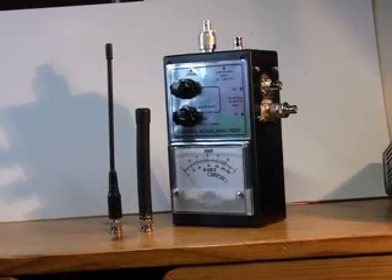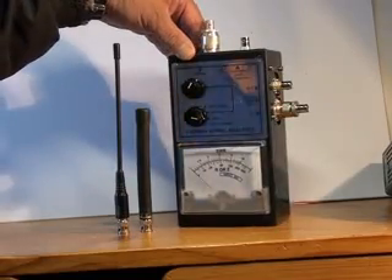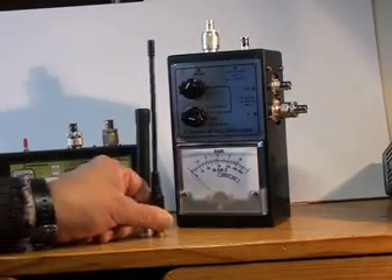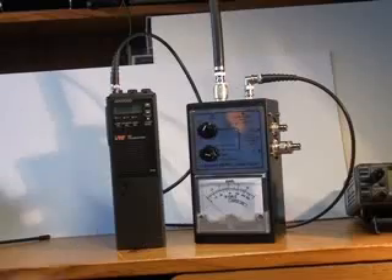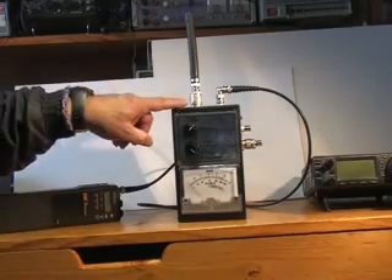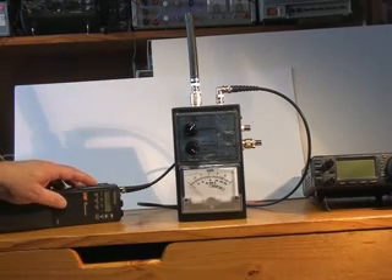Before putting the antennas on the bridges, I need to know what the actual impedance of these small antennas is. Here I have a VK5JST VHF UHF aerial analyzer. I'm going to use this instrument to check the impedance of these antennas. Once I know the impedance as measured by this analyzer, I can then put them on my bridges and see what results I get. The VK5JST analyzer requires a separate signal source. Here I'm using a small Kenwood handheld transceiver as the signal source. Here you see the small Kenwood whip antenna mounted on top of the analyzer, and I'm now ready to test its impedance.